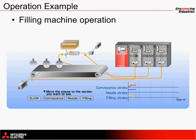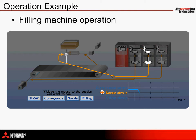The nozzle axis moves up and down to prevent spills from occurring and cannot move downward while the conveyor is moving. Toward the beginning of its stroke, you'll see that the blue line is flat, which means the nozzle is not only waiting for the conveyor to stop moving, but also waiting for the filling piston to take up enough fluid for the dosing process. Two cycles take place and you'll notice that the nozzle axis spends most of its time retracted in its stationary position at the top of its stroke, waiting for the conveyor and filling axes to become ready.